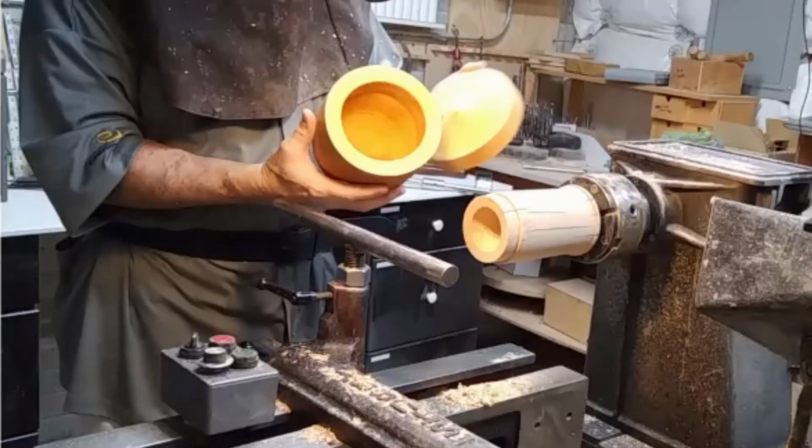Once I get to a certain thickness, a quarter inch or 3/16, I stop really measuring, and then I just go for smoothness. I'm constantly doing very, very light scraping cuts to get very smooth walls with no bumps. And to me, that's more important than ultimate thickness. The only time you really need to control your thickness really accurately, in my opinion, is if you're going to do piercing. Then you've got to be pretty close to 1/8 inch or less, and it's something I haven't ever done.